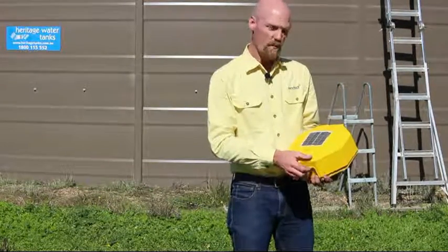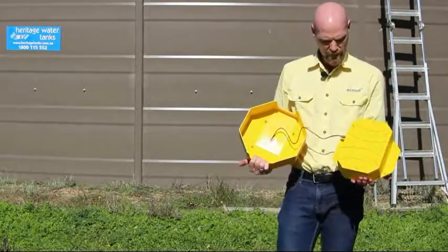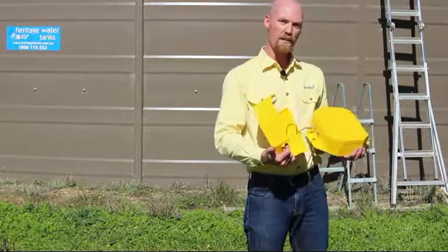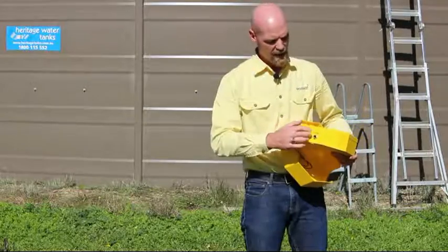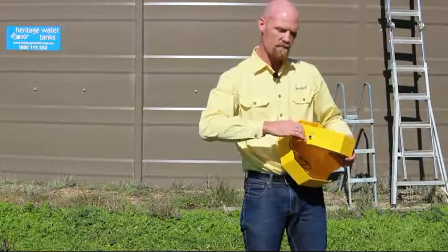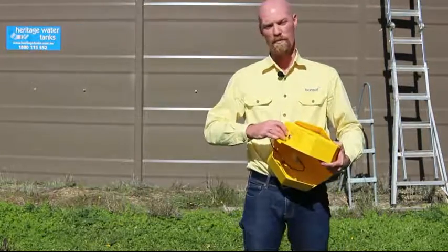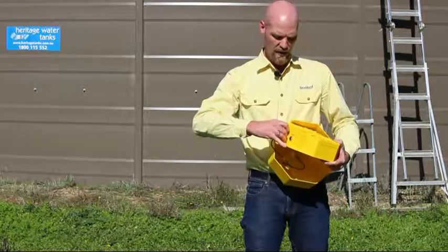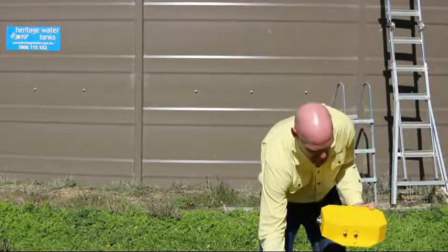For convenience, I've already removed those screws so the lid just comes off. As you can see, there are two connectors on the side: one labelled 'lid solar' for the UV protective cover, and one for external solar. For most standard applications — like one with only a single water bullet sensor — you won't need any additional solar panel. The standard panel is usually more than enough, so we'll disconnect that panel for the moment and put it aside.